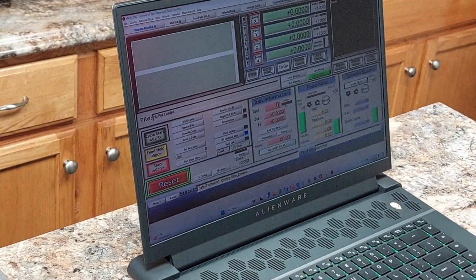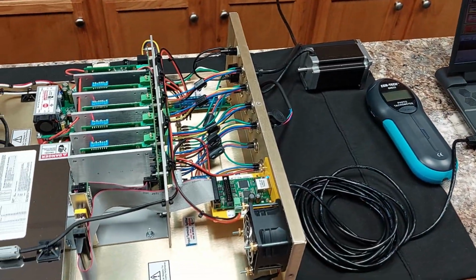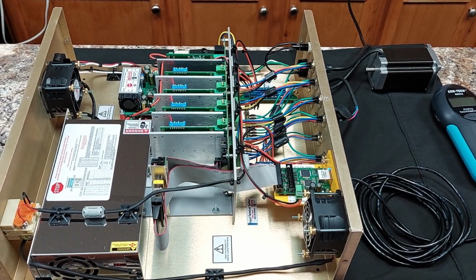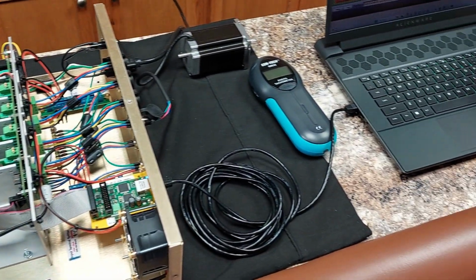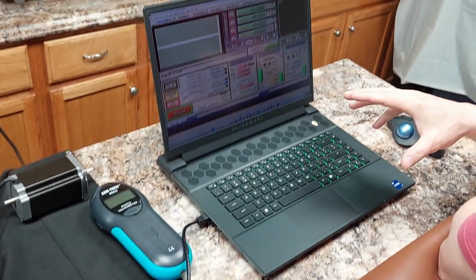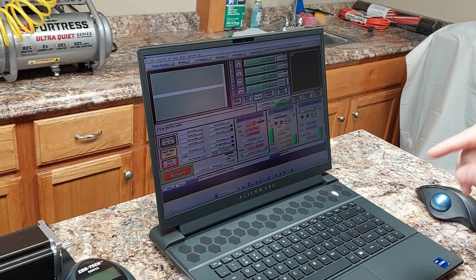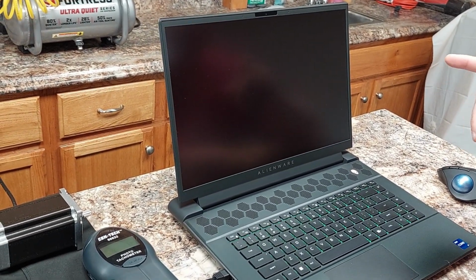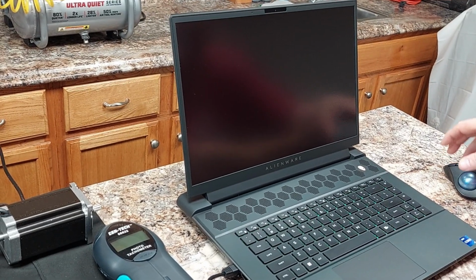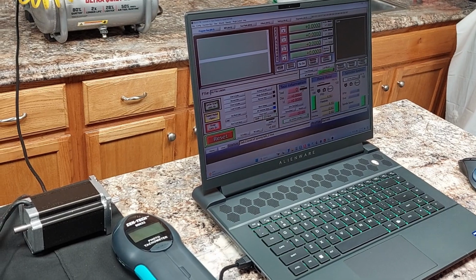Number one, we just seen RPM is definitively matched with Mach 3 motion control under inches per minute, but we also got to see the operational envelope of steppers in terms of what we've heard about how when you operate them, they miss steps. This motor did not miss a step at 5,100 inches a minute. It came right back to home. So you think about that, it's pretty incredible what we've just seen.